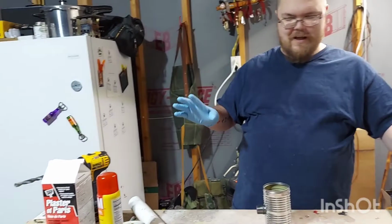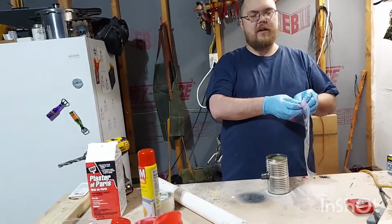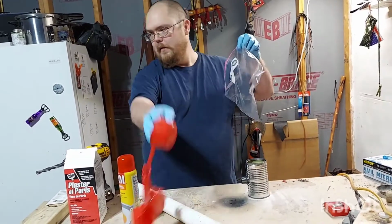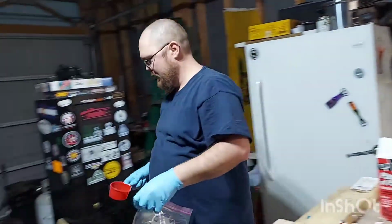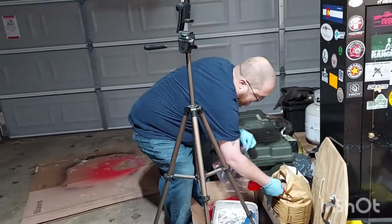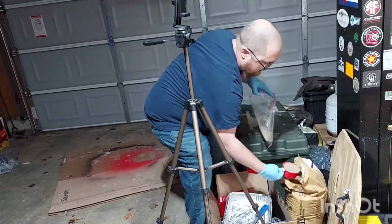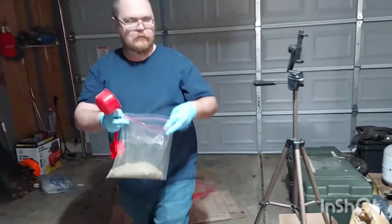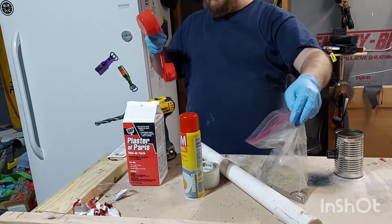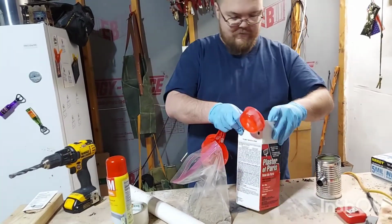Okay, now this recipe for the insulation is really easy. It's 1-to-1 sand to plaster of Paris. So, I'm gonna go over here. Everyone follow me. I just got some all-purpose sand right here. And I'm just gonna do 2 cups. And no, I don't use these cups for anything other than stupid stuff out here in the garage. So I'm not eating plaster of Paris or sand.